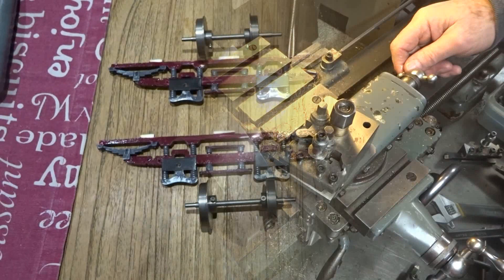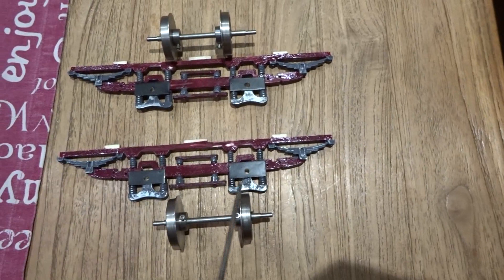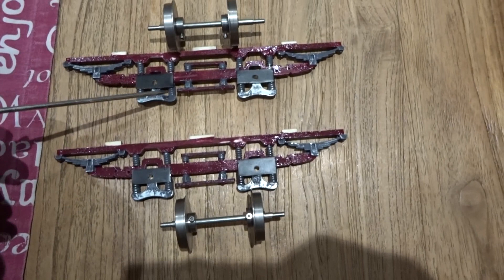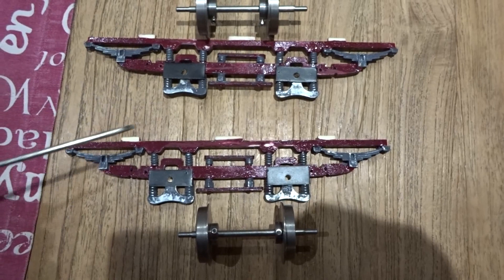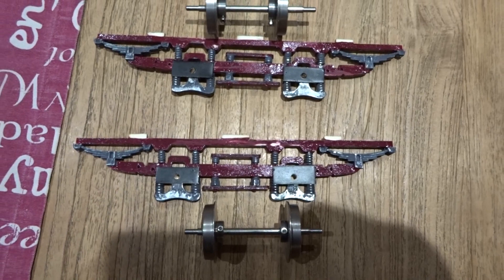To make this tram more suitable for the outside garden railway, I've made up two new axles and two wheel sets suitable for 45mm or 32mm gauge, engageable with set screws. I've drilled through the dummy spring supports that came with the kit — drilled those through an eighth of an inch — and fitted brass reinforcing plates. So the axles will also run on a combination of brass bearing and these original metal spring supports.